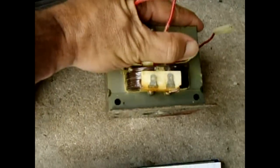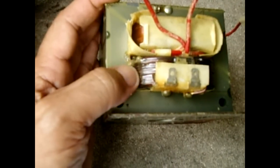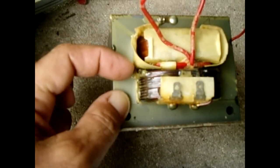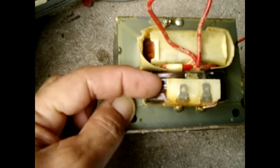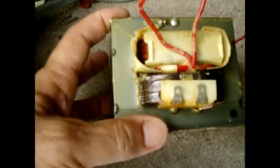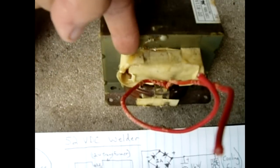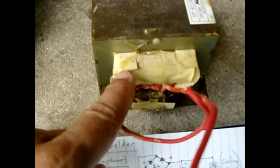When you chop out the secondary, make sure you don't damage or nick the primary copper coil below. Slide a piece of sheet metal between the two coils with masking tape on the bottom face to protect the enamel wire on the primary — a taped 3- or 4-inch drywall putty knife works well. Push it in tight, lay the transformer on the ground, take a sharp chisel right against the core, and hammer on both sides slowly until the end cap pops off. Then carefully tap out the rest of the core so it slides out.